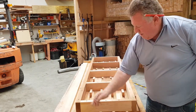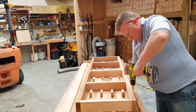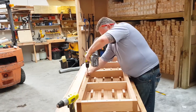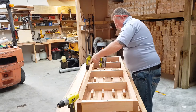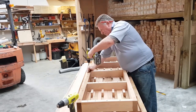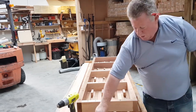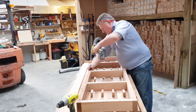I tend to do the one on the side here for these end ones. Just a little two or three millimetre recess — nice and tidy — and just gives a bit more bite of our material. I would say you might want to use the impact driver. Use stainless steel — I'm going to advise you to use stainless steel, please. Although not compulsory, I know years ago I was told that cedar would eat normal screws, and I have found that to be sort of a half truth. The preservatives in the cedar are very, very strong and they can damage screws. Even if they don't wreck the screws entirely, they will eat the thread and give nasty stains.